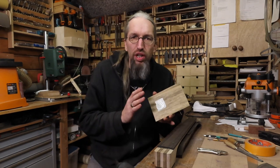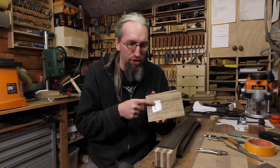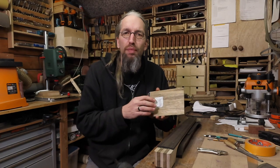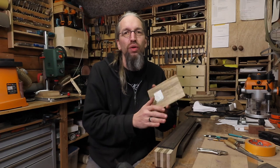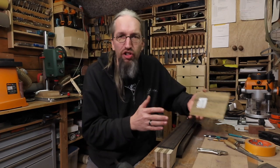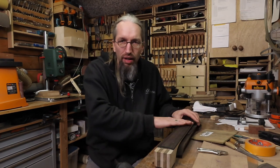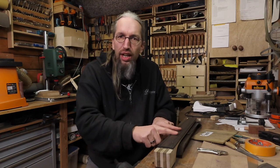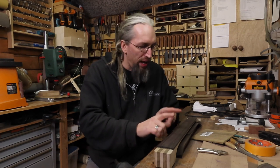The second reason for me personally is I use aluminum for my inlays most of the time, and aluminum sands away at a different rate than the wood of the fretboard. So there might be a possibility, especially with a bit larger inlays, that while radius sanding I accidentally create a hump where the inlay is. So I create a bit of a bow in my neck because the inlay won't sand away as quick as the rest of the fretboard. So that's my second reason.